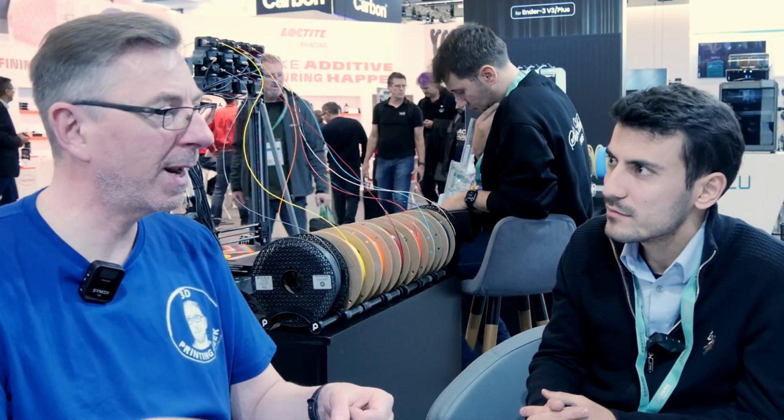You only need one cutter because you are cutting the current filament and then you retract that, feed in the new filament, and purge the remaining filament out of the print head. And I guess that also is why your system mostly uses less filament for wiping than other solutions. Yes. We are faster than the other solutions and we actually waste less filament right now, but still we have to clean the filaments and we make waste in this system.